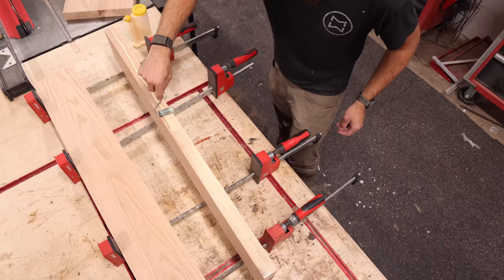It is now time for a complex, stressful glue up. There's a lot of surface area in these finger joints — box joints — whatever they're called, it does make for a really strong joint. Getting glue on all those surfaces quickly can be stressful, so lay everything out and if you have someone to help you, that helps. Typically you only need to glue one side of a joint, but I always like to glue both sides just to make sure I don't miss a spot.